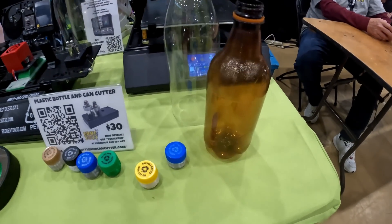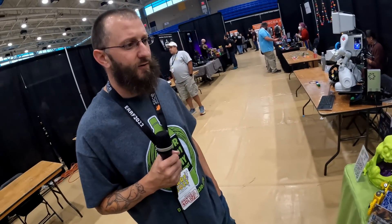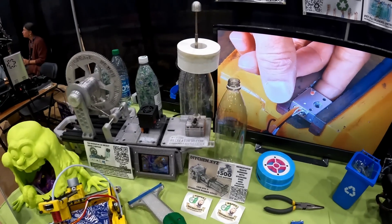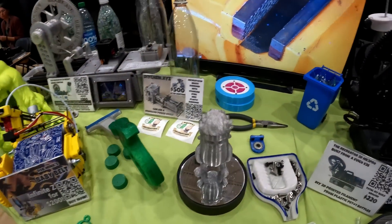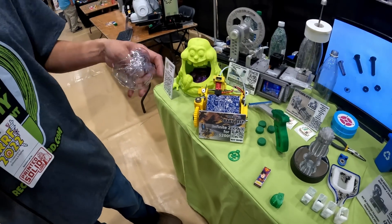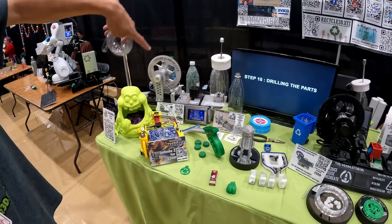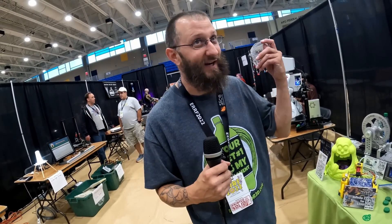What kind of bottles can you use for this? For the most part, you can use most standard PET bottles. We'll get into different bottles with different shapes — those shapes can be refined. We're going to pressurize the bottle and then twirl it over a heat source, and amongst the expansion it will straighten out. Most standard bottles are 0.30mm in thickness, which translates to an 8mm width strip going into a 1.75mm-ish diameter.